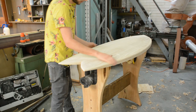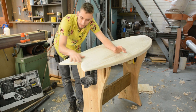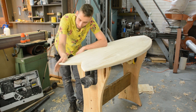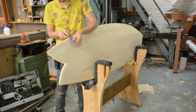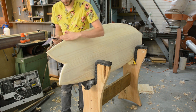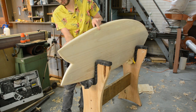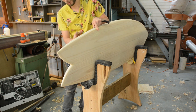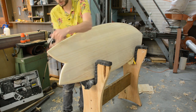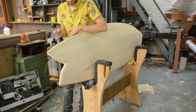That's all of the shaping with the rasps and the block plane. Now we want to finesse all of this rough shaping — after all we're creating lots of little flats into something nice and smooth — so now we come in with sandpaper, wrapping around the rail. We're being really careful not to hit the bottom of the deck. We really need to keep a sharp 90-degree edge for the tail section at least, so you don't want to be wrapping your paper around — you just want it riding on the radius and the flat.